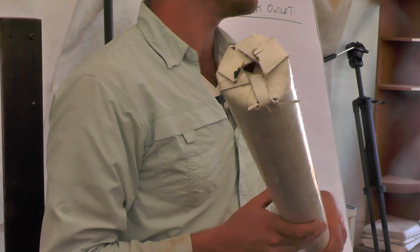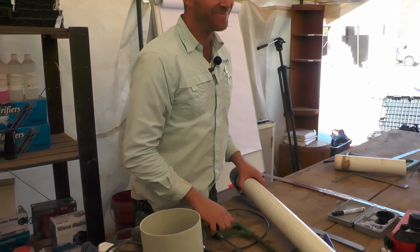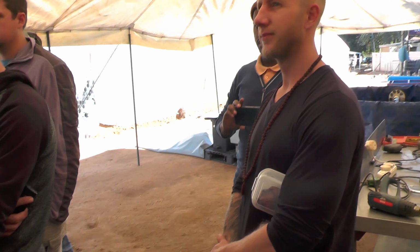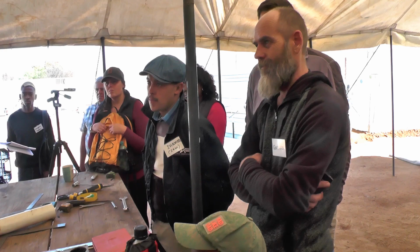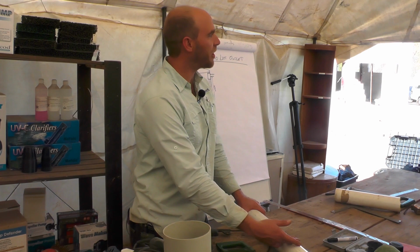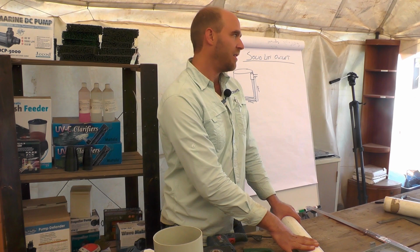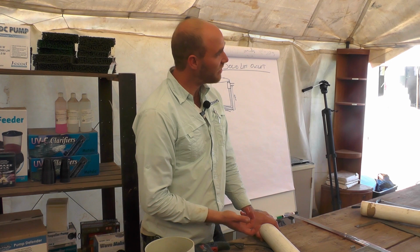The next thing I'm going to do is my grooves, my outlets. Now how do you know how big that outlet groove must be? By the size of the small fish you're putting inside. It has to be smaller than the smallest fish you've got. What I love with solid lift outlets compared to bottom drains and all other alternatives is as your fish get bigger, you simply swap it out. So you start off with a smaller one, but as your fish get bigger, it might block up too easily. You just swap it. And we'll often have multi-sized outlets as my fish get bigger. And the ability of being able to take it out of the tank, clean it and put it back, the simplicity of it, for me, makes it the preferred method of drainage.